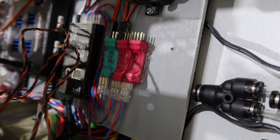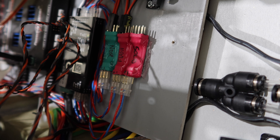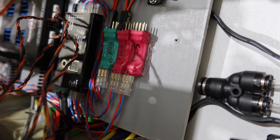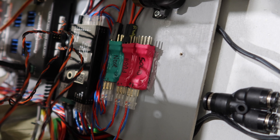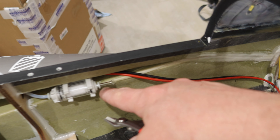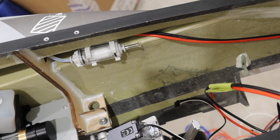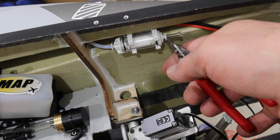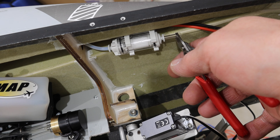These MAP tanks are nice and simple, affordable, and they work great — they've got a nice massive pleated filter. The MAP tanks include a reducer: you've got an eight-millimeter Festo tube on the pickup line, then it loops around and goes down to a six-mil Festo fitting on the pump. So you go from eight-mil to six-mil with a short section of six-mil that plugs into the pump. Both are made up the same size and ready to be installed once more wiring is completed.